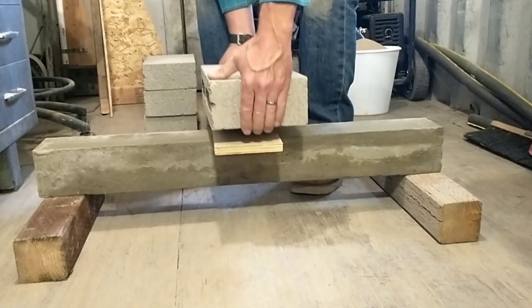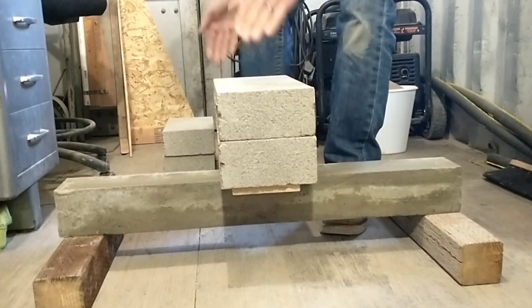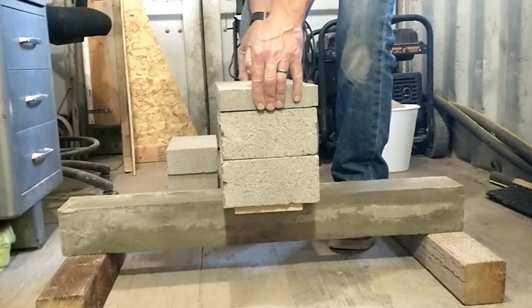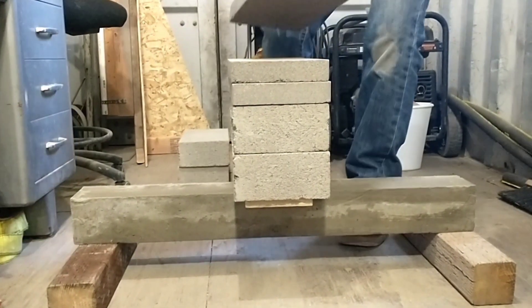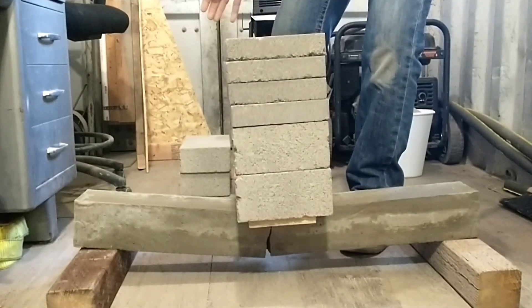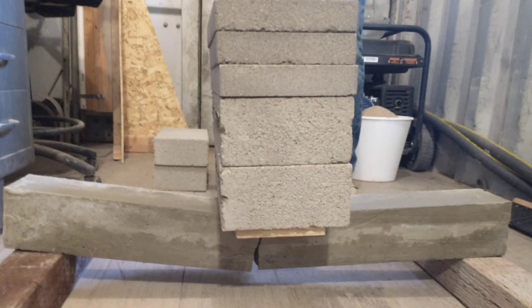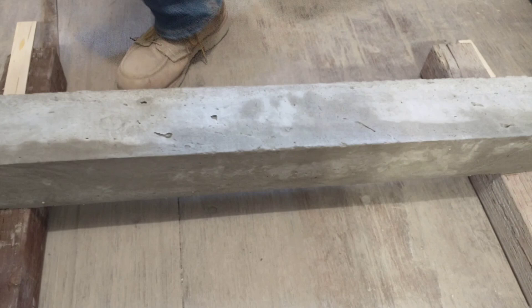Moving on to the tensile strength test for the ribbed wire reinforcement — this sample has two strands of fairly thick ribbed wire with indentions crimped into it that give the aircrete something to hold onto. It's a product made specifically for concrete. As I'm stacking weight on it, it's taking quite a bit and doing very well. When it finally gives, it cracks but never touches the floor — it cracked and held. Even when the aircrete gave way, the wire held and it only gave about an inch, still actually holding the weight. This sample ended up holding just over 90 pounds or 41 kilograms, about 25% better than the standard mix which held 70.5 pounds or 32 kilograms.